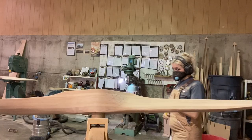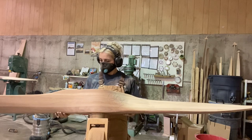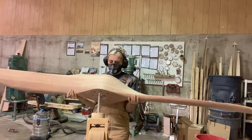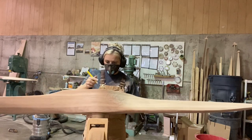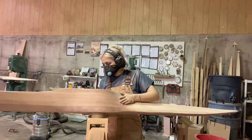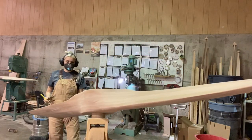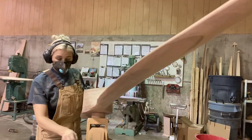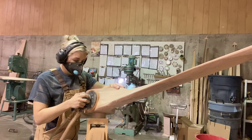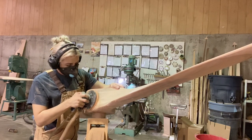Balancing it was actually not terribly bad — not bad at all. But it is kind of hard to decide where you want to sand to take that weight off. You look for places that have a little bit of a dip, or I decided there was a little bump in that spot I could take out. You're also comparing it to the other side, and because I didn't have a very good template and had to do so much by hand, I really had to judge — look at one side, look at the other, do they look about the same? There's just so much material to work with that it made it super hard to tell where to take weight out to make it look symmetrical. It was a little rough.